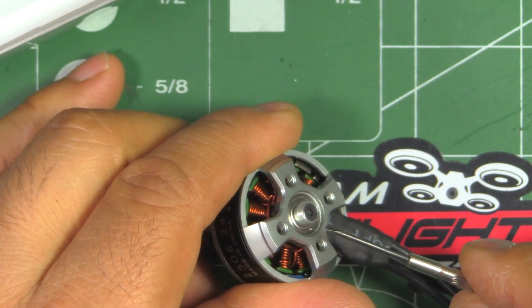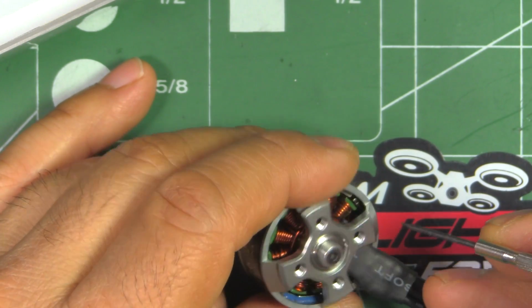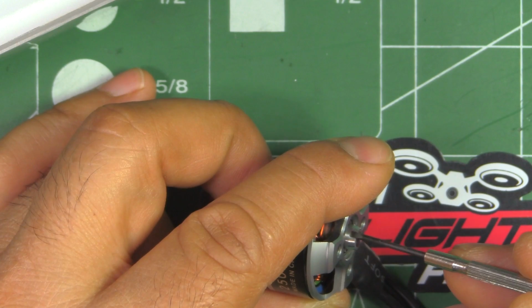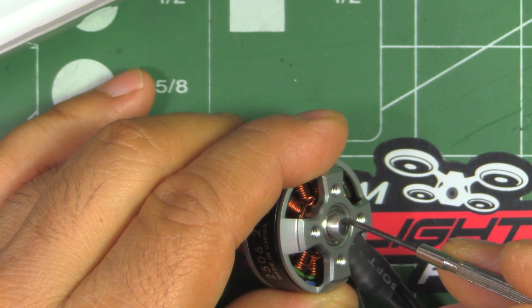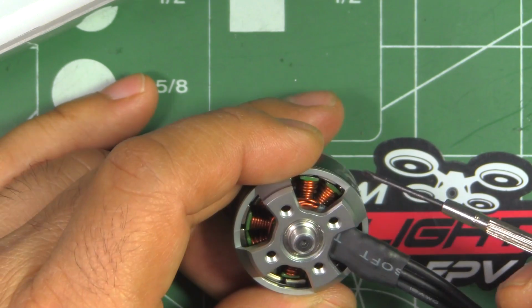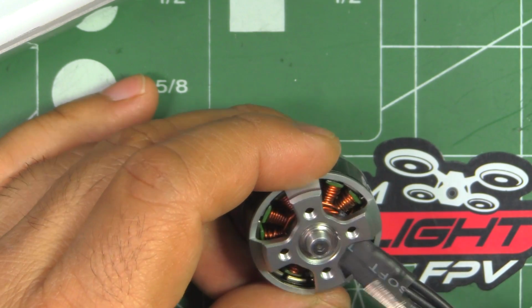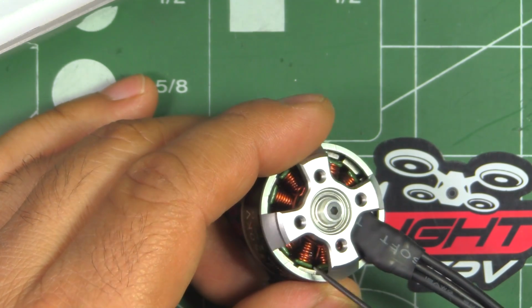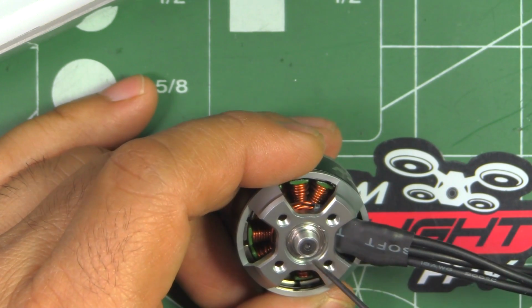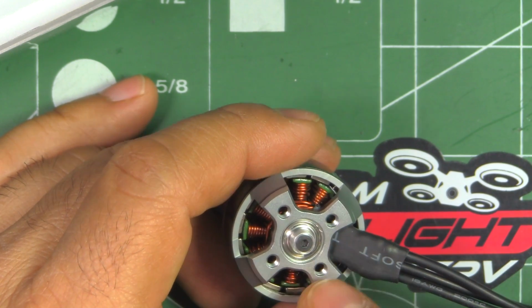And as you can see, they're using a capture screw to retain the shaft. And a kind of interesting way they did it is they're using this somewhat tall washer here. It's an aluminum washer, and the screw is inserted into it. So, an interesting, different way of doing it. Other features that it has are N52SH magnets, and these are arc magnets. They're curved. It looks like a single strand wire, heavy duty wire. NMB Japanese bearings, 4mm bearings. I believe those could be 4x9x4, and it's been, of course, dynamically balanced.